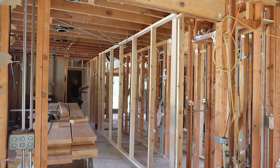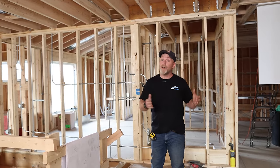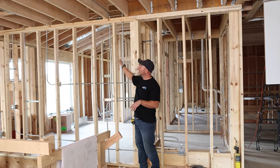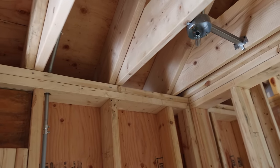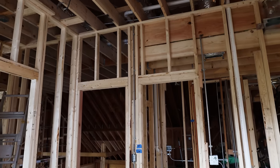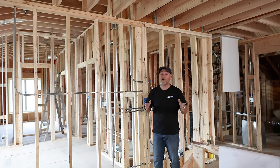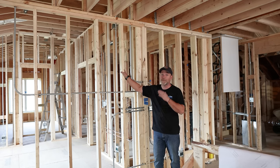Our temporary wall is up and we're ready to move on to the load bearing wall. So what is a load bearing wall and how can you tell whether a wall is load bearing or just a regular partition wall? This is a perfect example — it has a double top plate. 99% of the time a load bearing wall is going to have a double top plate; that's just the way they are built. You may run into a situation where a load bearing wall doesn't have a double top plate, but that's a big no-no and you need to investigate further. Contact a framing contractor or a structural engineer and they will be able to tell whether or not the wall you're trying to remove is load bearing.